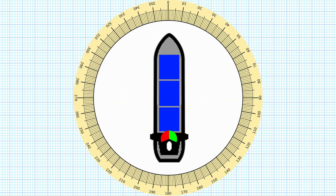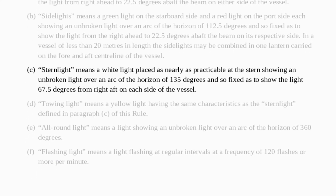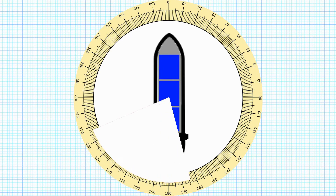This is only on vessels less than 20 metres. Next we have the stern light which is a white light placed as nearly as practicable at the stern, showing an unbroken light over an arc of the horizon of 135 degrees and so fixed to show the light from 67.5 degrees from right aft on each side of the vessel. This is actually just going to join up with those side lights so it's going to be two points above the beam. So looking at a stern light on this diagram it's going to start two points above the beam on the port side and run right the way round to be two points above the beam on the starboard side.